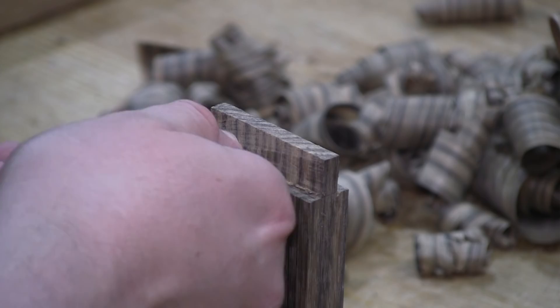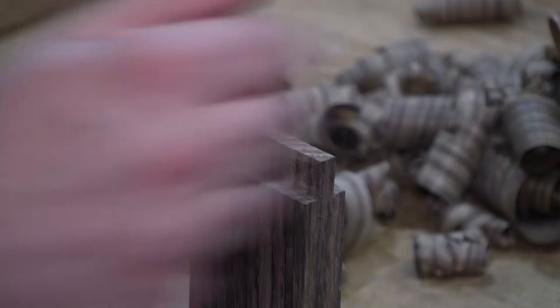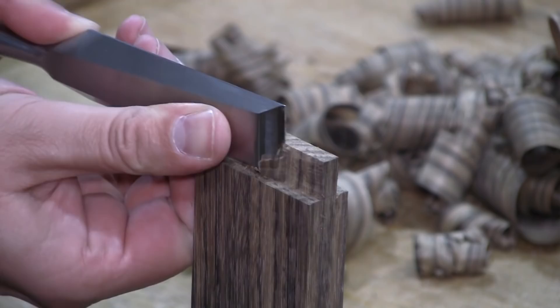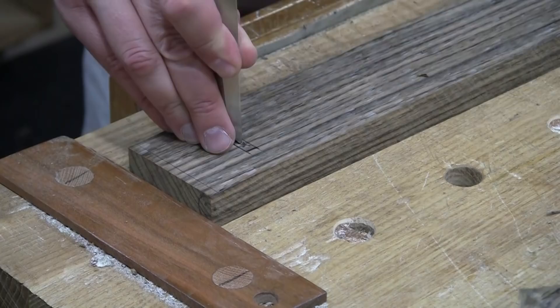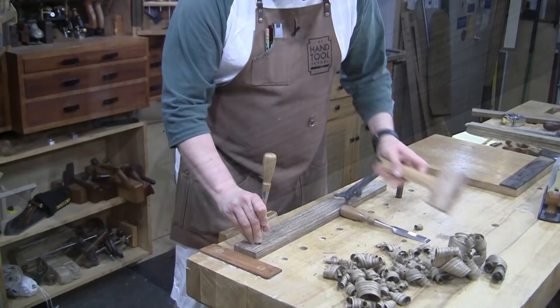I've got another piece of shedua here that I've already prepped — I use the same tools to rip it in half, cross cut it to size, mill it and everything using the jack plane. I need to cut mortises on either end to house those tenons I just created, and I'll use a quarter-inch chisel. I've got a fancy mallet here but honestly any old mallet from the hardware store will work — or grab a 2x4 and use that as a mallet. You can build them out later on; in fact that might be a good first project.